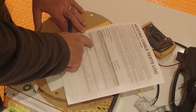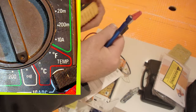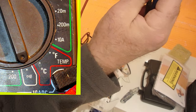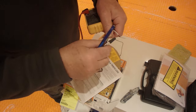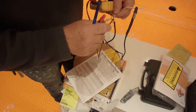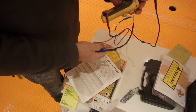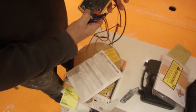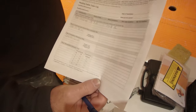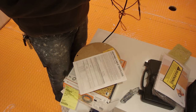The reading is 17.9 to 17.8 ohms — that's within 10% of the factory value of 17.7, so the conductor resistance test is a pass. Now for the conductor-to-ground test: I set the meter to alarm mode so it beeps if you touch the leads together. Put one lead on the wire and the other on the ground wire. It reads 'I' which means infinity or overload — that test is a pass as well.